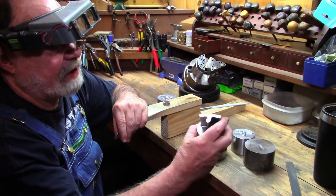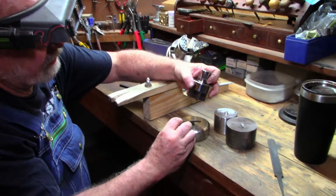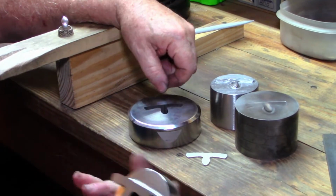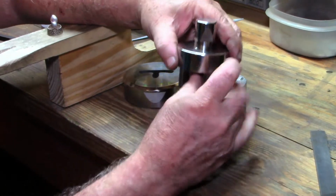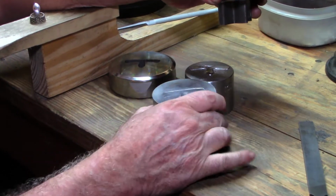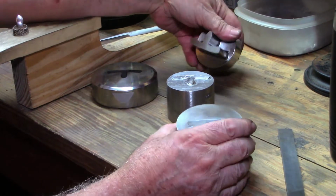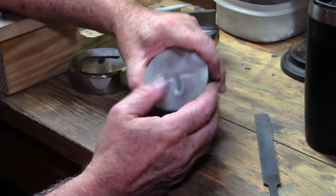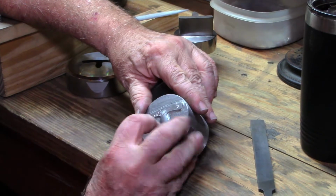This time we started with the cutting die, and this punch. See, these work as a set and they cut out these shapes. So to keep our stamping dies the exact same shape, Timothy took this die and just added a little pressure, just enough to get a perfect outline into this die. So this is multi-purpose. This is kind of a blank master die. And from here, we created a working hub that can be engraved.